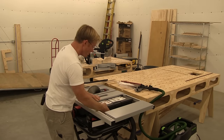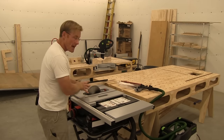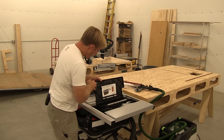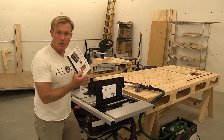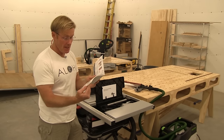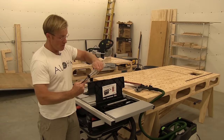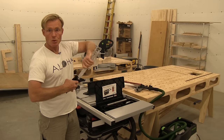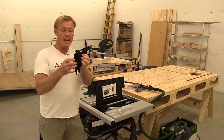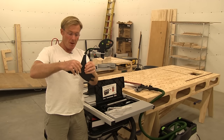Beneath the surface of the table there's a toolbox with instructions on turning the stop feature off and on. If you want to disable the stop, there's a certain protocol you go through, and that's very clearly laid out there. In the toolbox they've included a really nice, easy-to-follow, well-written manual made with thick coated paper, so it's going to stand the test of time. It also has the blade guard, which is removable by pulling with no tools. And then you have the riving knife, which you can use along with the anti-kickback pawls — those can also come off without any tools, just by latching the spring.